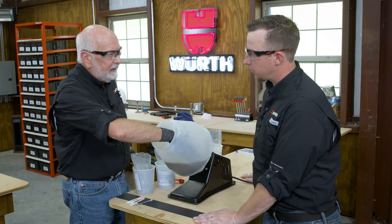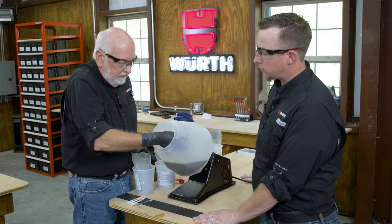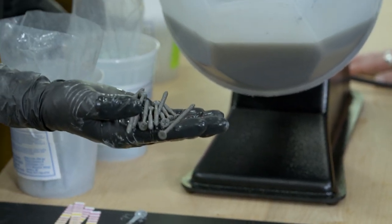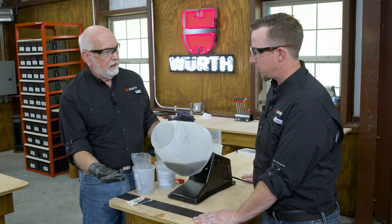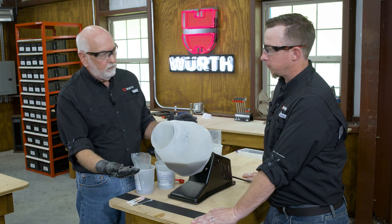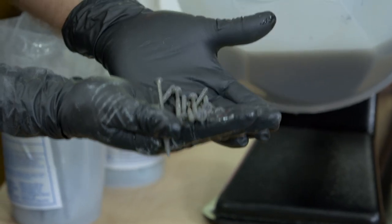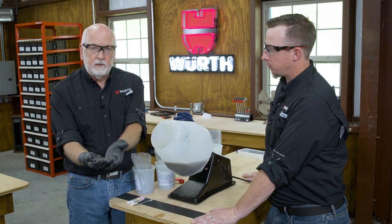I think this looks about done. We've let it tumble — it doesn't really take very long for the zinc. Let me reach in there — they were copper the last time I pulled them out — and now look at that: there's zinc. That is zinc plating. What happens in the process is the entire barrel gets dumped out, it goes through magnetic separators so the metal fasteners are separated from the glass beads, and then it goes into a drying operation — just an air dry. We have the right amount of zinc thickness. These screws probably have anywhere from 5 to 12 microns, fully and evenly covered. If you want a chromate, you put a chromate on there; if not, they go to packaging.